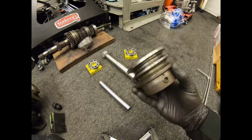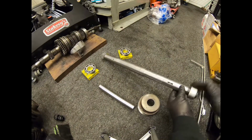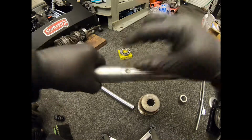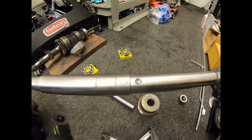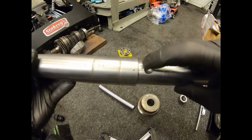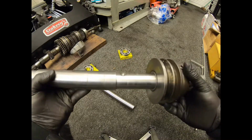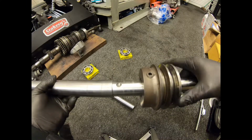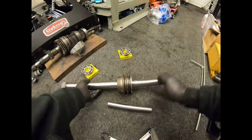This is the pulley. This is the top two groove pulley to match our other one here. So that's at the base of the machine. This is at the top and goes on the spindle here. So we take off this left hand nut. The pulley was a nightmare to get off of here, so I chucked this whole thing in the lathe and I just used a bit of emery cloth and then also some Scotch-Brite pads to just clean it up. And then I did actually take a very fine cut here where the two set screws go because it had burred up a little bit. But now, as you can see, it does actually go that way around. There, perfect. So that's ready to go back in.